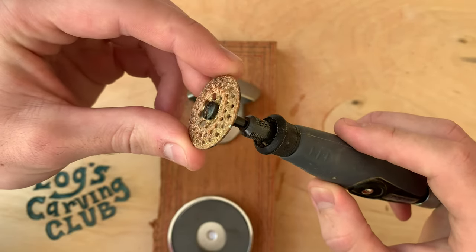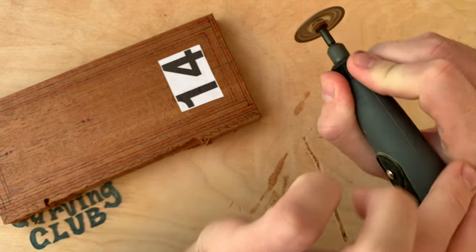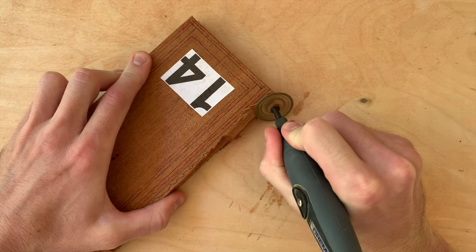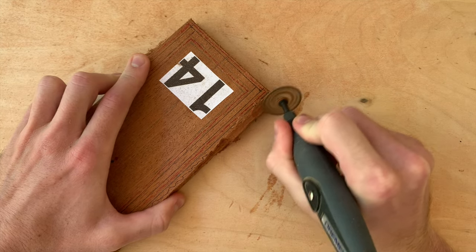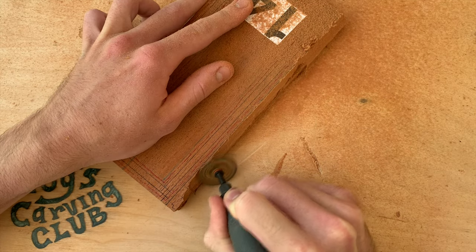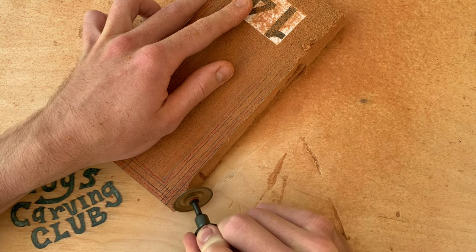To start out I'll be using a Dremel flex shaft on my Dremel 4300, and I need to cut a semi-straight line onto the side of the lumber, so I'll use the Dremel 801 at 30,000 RPM. I have a video on this accessory — I really think it's great for stuff like this. I'll put Amazon affiliate links for all my tools and bits in the description below. Those links give a little commission to me, but the cost is the same for you, so I guess it's a little less money for the man.